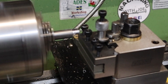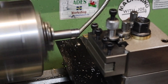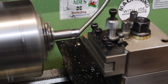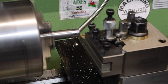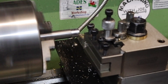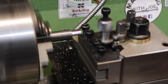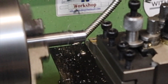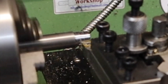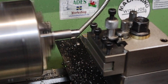It's funny using this little old lathe — it's been quite a while since I've been on it. That went up quite easy, so let's do a 0.5mm depth of cut this time, double the depth of cut. It's the only problem with not using a lathe for so long; I forget what it's capable of. I'm looking for 2mm on the DRO. Once we get to that sort of point I'll take some measurements.